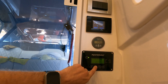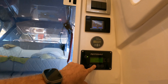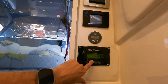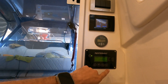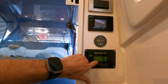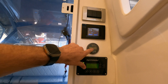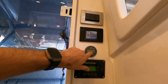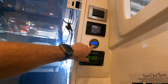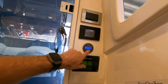I can see that we are connected to shore power now. I'm going to reduce this because we're hooked up to a 15-amp outlet — I'll change this to about 13 amps so that the existing chargers will keep up. Now you can see we're putting 100 amps into the battery, with 70.7 amps total going in with the AC unit running. We've used a total of 115 amp hours and that number is going to keep going down since we are charging the battery now.